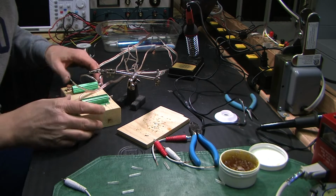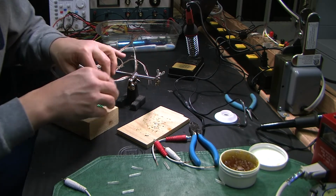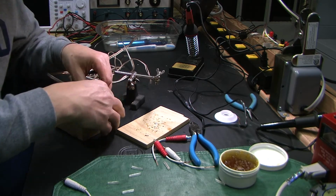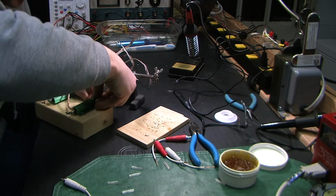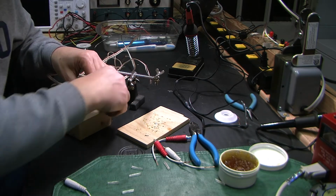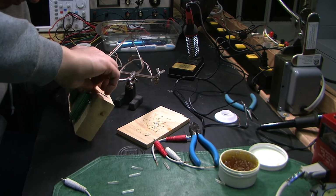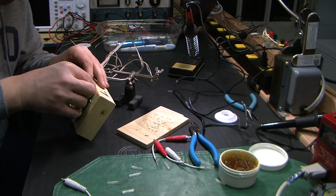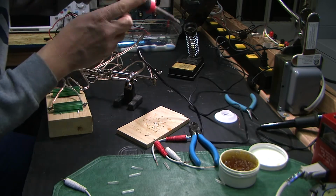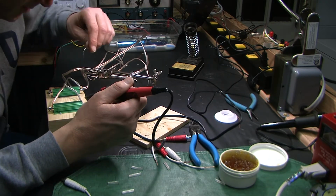and then from there you go into a Class A common emitter type voltage amplifier, and then that feeds complementary output transistors in a push-pull arrangement. Sometimes with a Darlington pair, it's two of them together for, if I remember, it's called a beta or something.